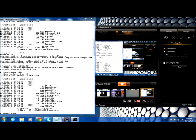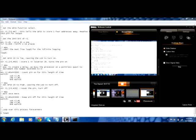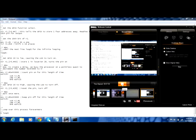Just for thorough purposes, I said we'd talk about the fact that we could change how long it blinks for, and that's why I changed this to an F prior. If this is an F, this number is much longer in hexadecimal, so it would stay off for a lot longer. If we were to change this, for example, to a 1, it would stay off for a shorter amount of time, and the blinking would be faster, with more time where the light was on. Anyways, that is Raspberry Pi Lesson 2. Thank you.